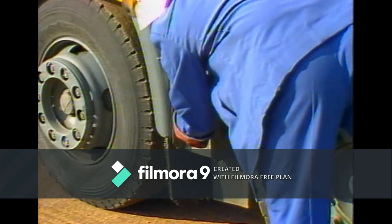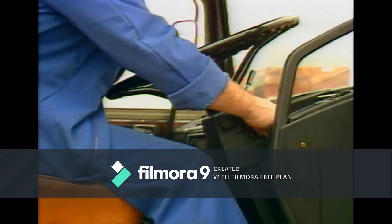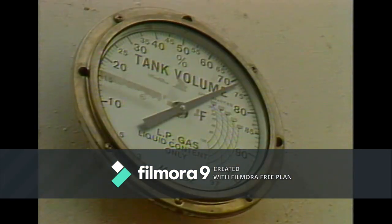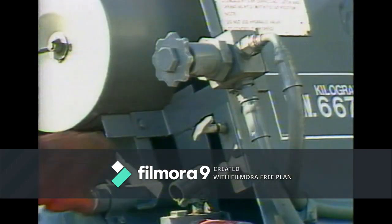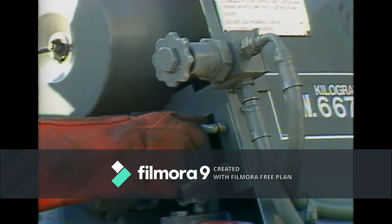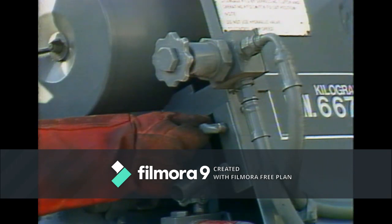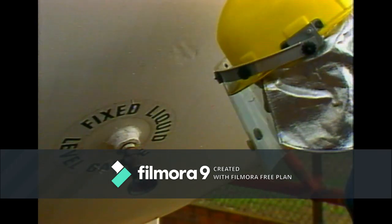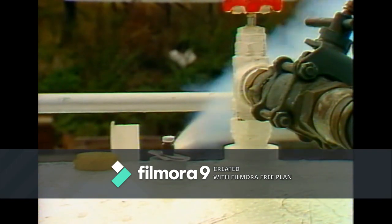Start the vehicle engine to operate the pump. During discharge, the driver must always keep the vehicle and tank in view. Keep checking the level gauge on the customer's tank. When nearing the end of the load, slow down the pump. If the tank is to be filled to capacity, the ullage gauge must be used to decide the shut-off point. Overfilling is dangerous, and correct use of the ullage gauge will prevent it.